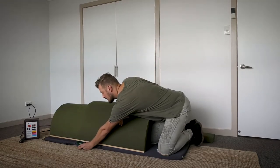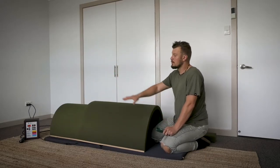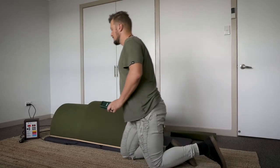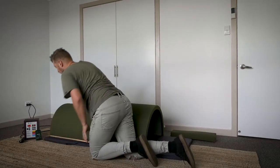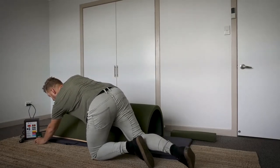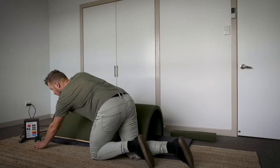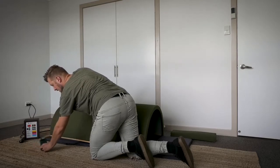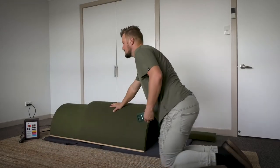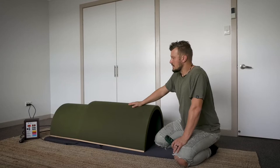If I go directly to one of the cables, I have a 0.4 mGauss reading on the main cable. A really high reading would be directly at the power box — but that drops off within a couple of centimeters. Just to point it out and not hide this: a reading of 10 directly on the box. Going 10 centimeters off, still about 9.7. Dropping down to 2 at around 20 to 30 centimeters away, and dropping to 0.5 after about 40 centimeters. So the transformer in this box does cause a reading, but that is not where you lie when you are actually having your infrared therapy.